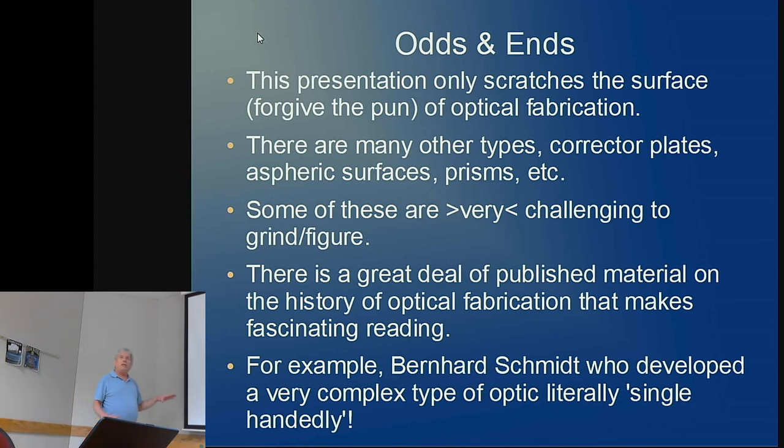And it's really a neat deal. You take a pan, you put your flat glass plate on the pan and seal the edge, suck a certain amount of air out, which deforms the glass slightly, and then you grind and polish a sphere into that glass. And when you let the air back in, the glass goes back to its natural condition, and you get a plate that has a very strange curvature to it. And it's very useful to make very fast, very large diameter cameras. It's called a Schmidt telescope.